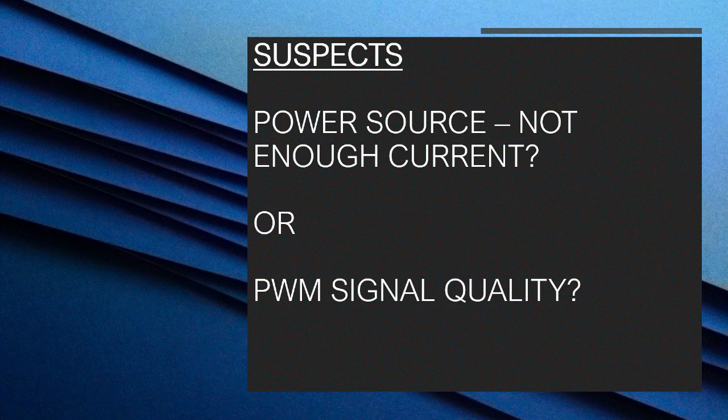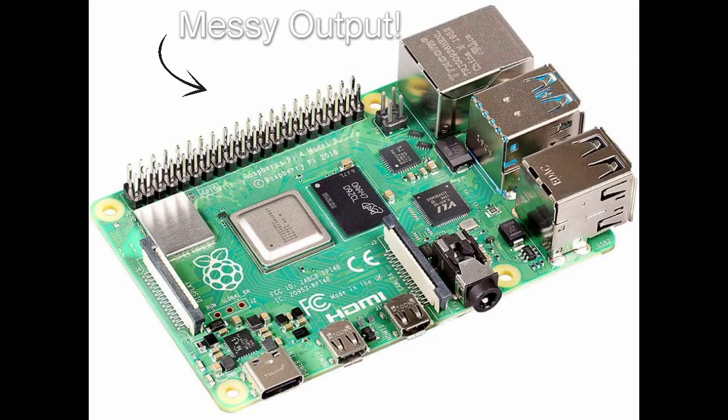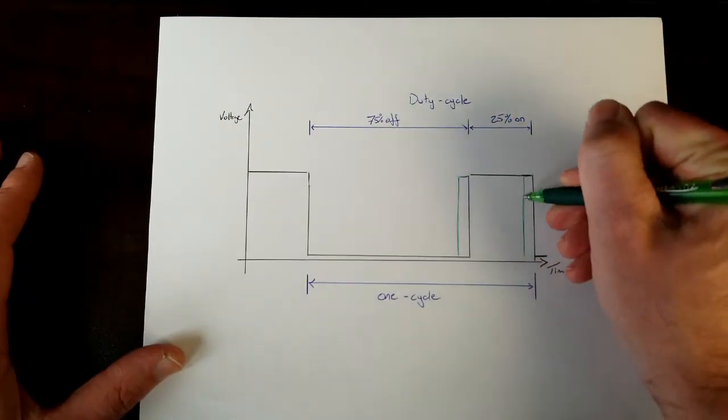If your signals aren't clean or your power source is weak, the servo will hunt for its rest location — like the wonderful little camera mount on my project car. So signal quality or power source is the problem. I know that Raspberry Pis have an issue with a clean clock output. That probably means the PWM signal is the culprit and has a high likelihood of wandering around and driving a changing duty cycle, making it hunt.